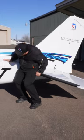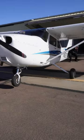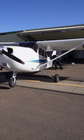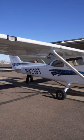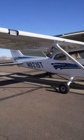Then, to rotate the plane, press down on the empennage at a safe point over a rib. Always use caution and beware of flexing on the skin of the aircraft. Lift the front wheel off the ground and reposition the airplane, then set the airplane back down and repeat if necessary.